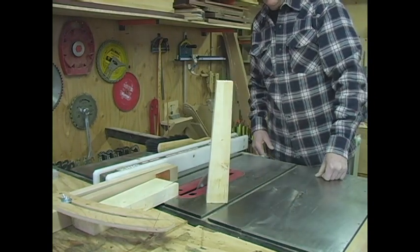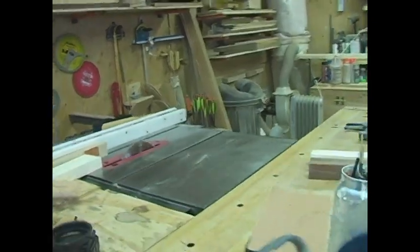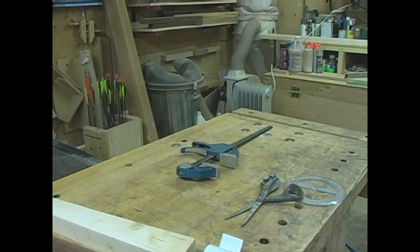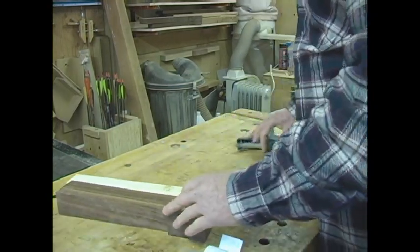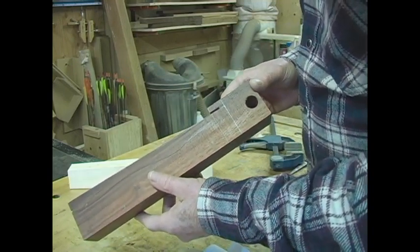This is a generic taper jig, and we're going to use it to make designated jigs so we can have repeatable angles for the bows. It's very simple — two pieces of maple, a hinge on the end, and a subtle curve at the top to allow the jig to open to cut various angles. The plank that you're cutting has to have a stopper on it. I use double-sided tape because every angle requires a slightly different position, so I put a small block of wood up against it as the pusher through the saw.